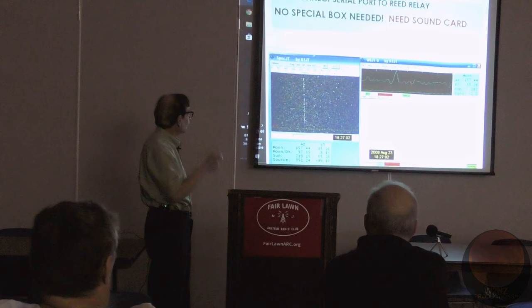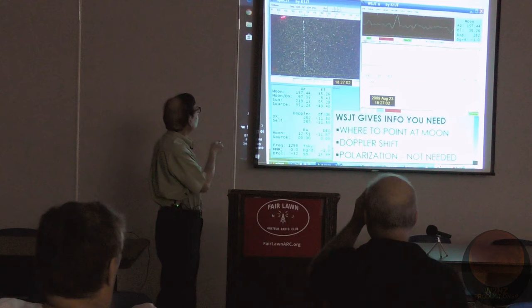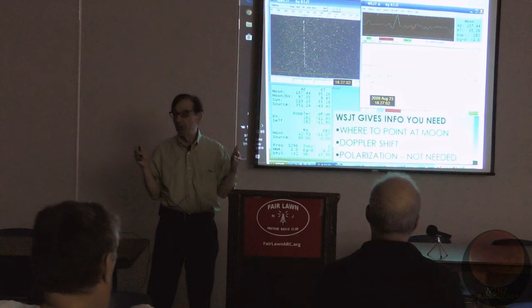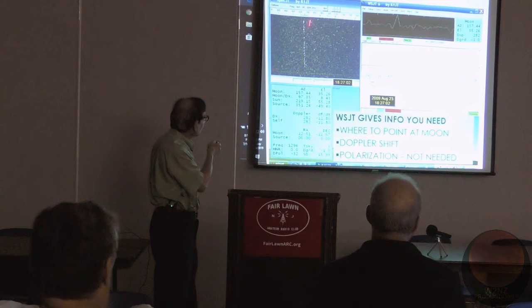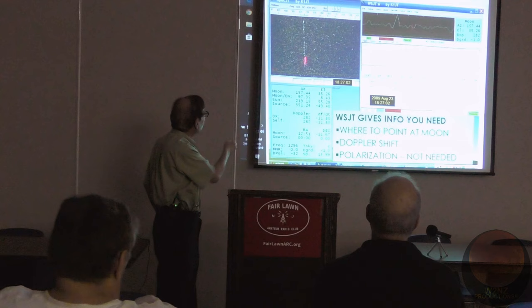And this kind of shows you a picture. I showed you something similar to this. I guess this is the same shot I had before, but this is a screenshot. This is frequency. As you dial your receiver, this moves across the frequency because this is based on the audio out. You're looking at the audio out of your receiver on your computer. It comes in the sound card. And so you can see, there's a station there. Okay, and then what you actually do is you take your mouse and you click right on this. When you see a station, you click on it, this little cursor here will jump to that and it'll start decoding and it'll tell you if you got a station there or not, what you're receiving.